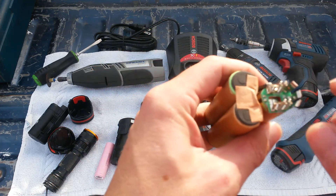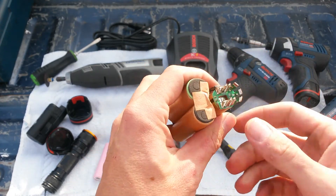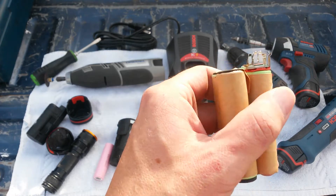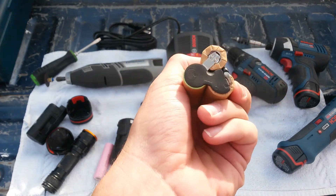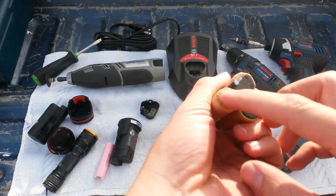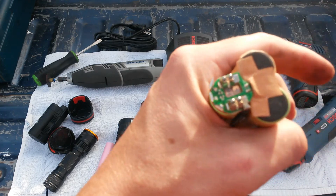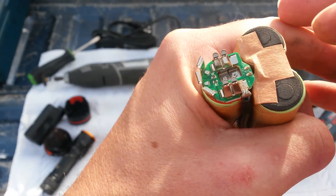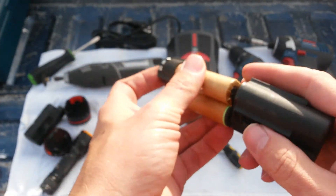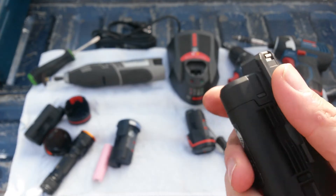Since it is a pretty crucial part of the battery, if you broke that apart and wanted to put it back together, I would recommend doing it with a spot welder. If you don't have a spot welder, you could lean those tabs down in and use the battery case to hold it all together. But ideally you want that point to be pretty solid, so I'd recommend using a spot welder. That said, if you've got a dead battery pack, you might as well try it — get tabbed batteries, do all the other connections with solder, then for the top one just lean the tabs inward, press them down, put the battery pack all back together, and hopefully you'll get enough pressure on that point that you won't get a degraded battery contact.